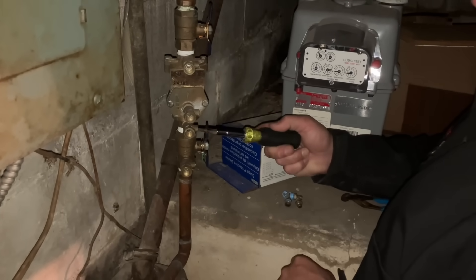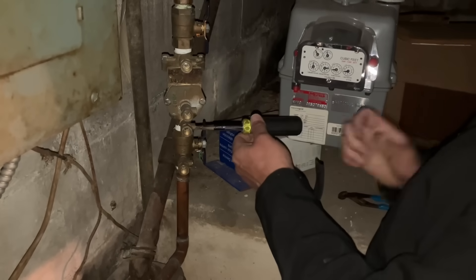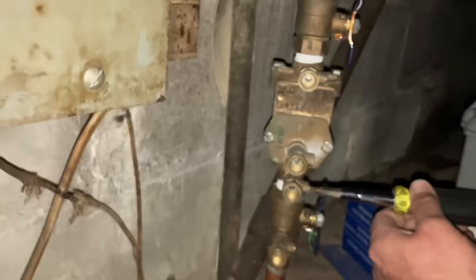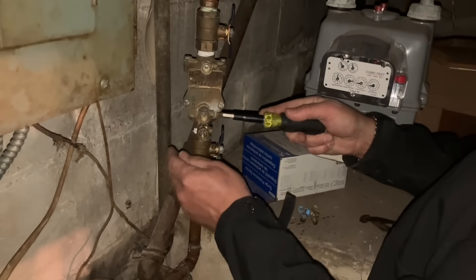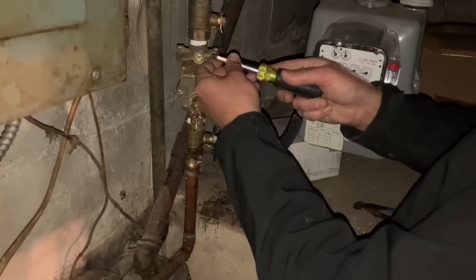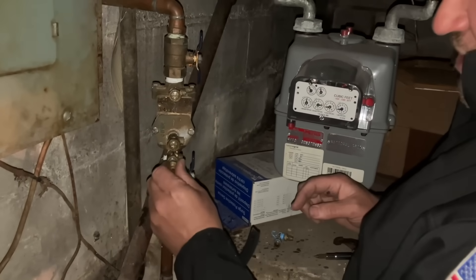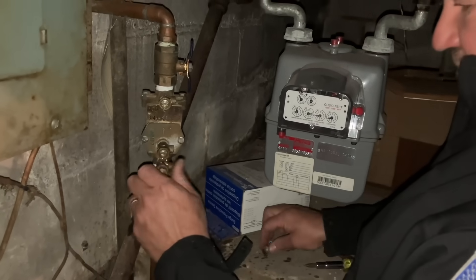We're going to make sure there's no debris stuck in there. I'm just going to take this flat screwdriver, put it into the valve, and slowly open this just to get any debris out of there. Just like that — see a little bit, it's a little spitz. Okay, now that they're all clear, I'm going to hook up my gauge test port adapters to test ports two, three, and four.